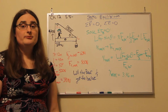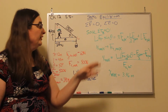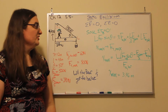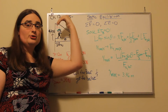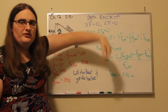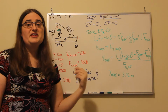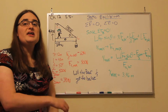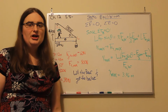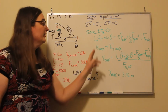in our cable. So going back to the sum of the torque equation that we worked with, if the sum of our torques in our z-axis equals 0, our counterclockwise torque needs to equal the sum of all of our clockwise torques. So our counterclockwise torque is from the tension in the cable if we calculate our center of rotation being from around the hinge, which had forces that we didn't know the size of in part 1.